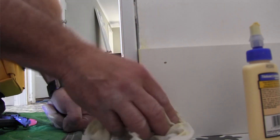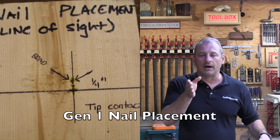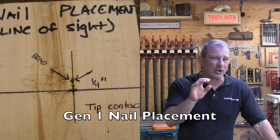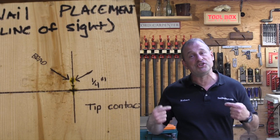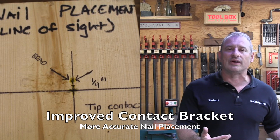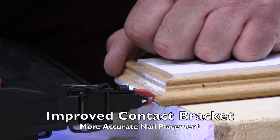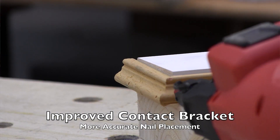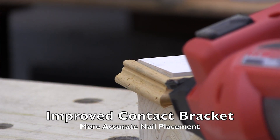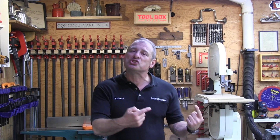They also adjusted and changed out the contact bracket tip. The Gen 1, when we tested it, was 3/16 of an inch off-center on the model we tested, and there was a lot of play in that bracket. Milwaukee improved the contact bracket by reducing that play — or wobble — and that improved fastener placement accuracy. I was able to place fasteners spot-on. They basically just solved the issue.